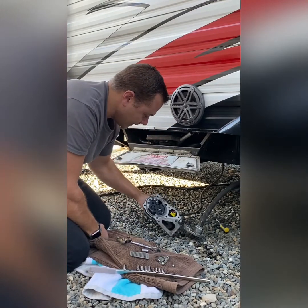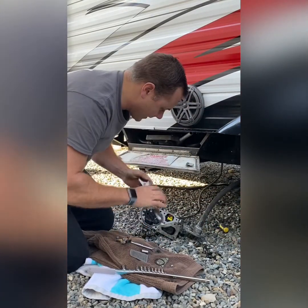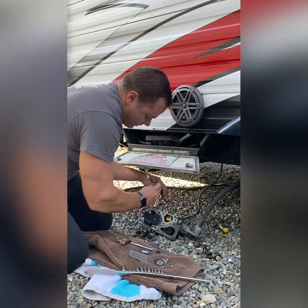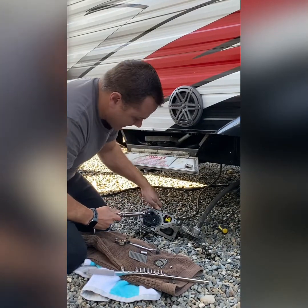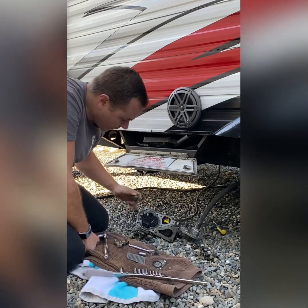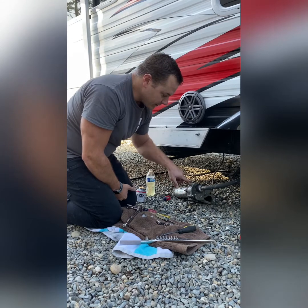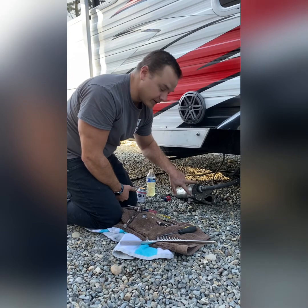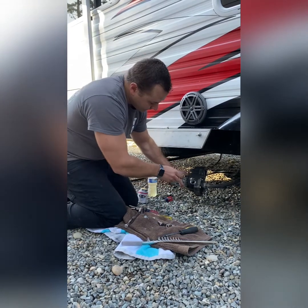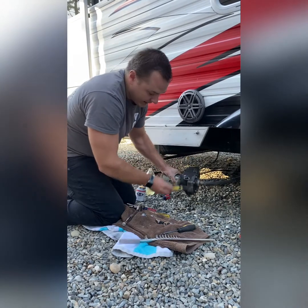To fix this, right here is a purge valve. If you run your fuel pump empty, you can take a 3/8 socket, stick it in here, take this out, and you're able to fill fuel in here. Once you close everything up and fill this with fuel to get a good suction, hook all the lines back up, and that will solve the vapor lock problem. I've got the covers back on in reverse order. The impeller cover and strainer cover both have gaskets, so I made sure to tighten the bolts evenly to not damage the gasket. Now, with this plunger valve access point open — inside is a spring, and if you push down on the plunger valve it opens up, allowing fuel to go into the pump.